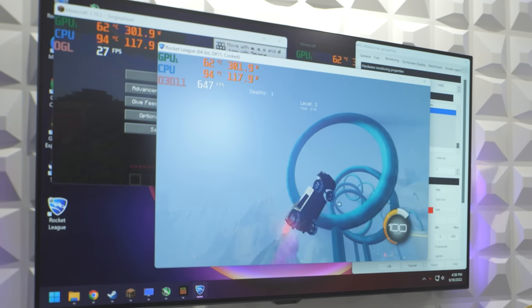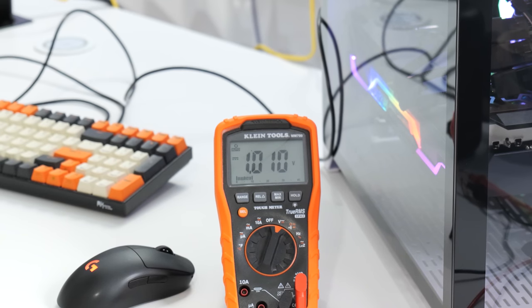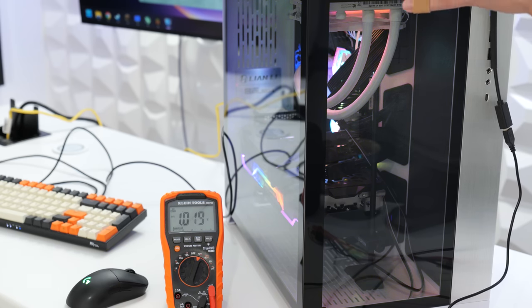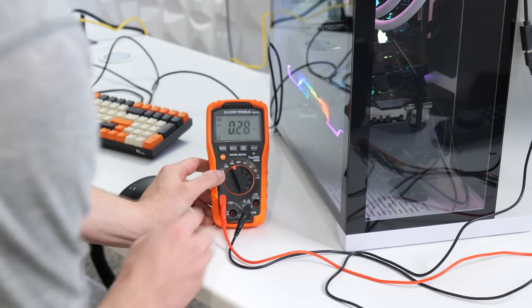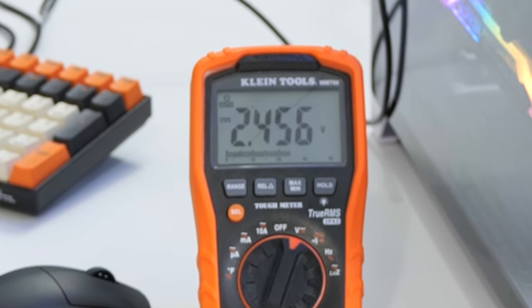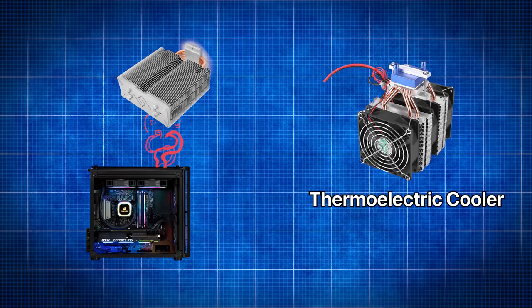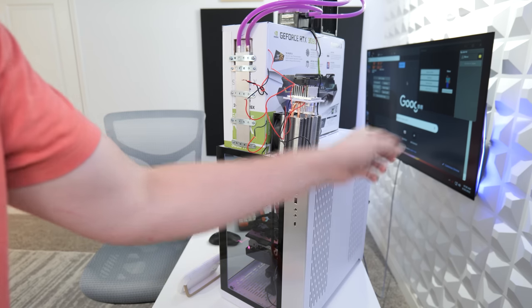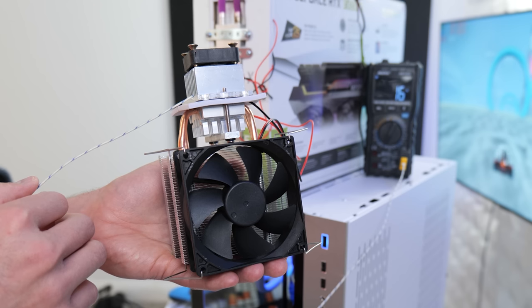To increase the voltage I wired two modules in series instead of parallel — we're past one volt! Wired another set into series — we're up to two volts. Because I touched the wires: 2.1 volts at almost 300 milliamps and climbing. Wired the last one into series — all in series now — 2.4 volts and steadily climbing. You could use this current on the same technology as a mini air conditioner to turn electricity back into cold air. We've turned hot into cold — ambient room temp is 22°C, and we're getting 16°C.